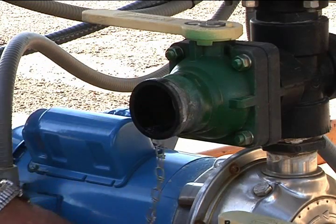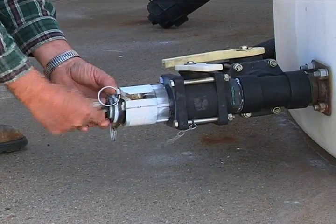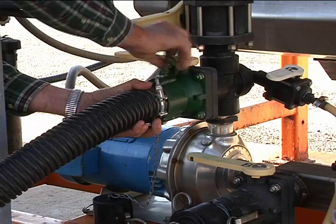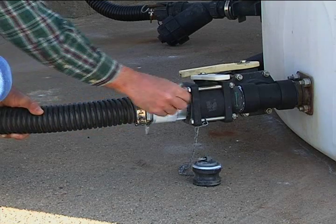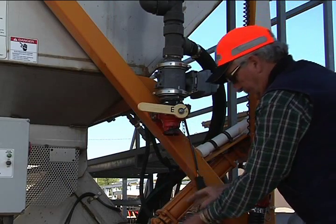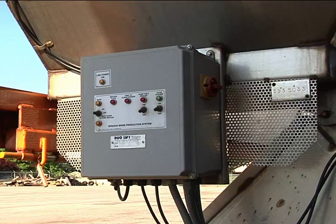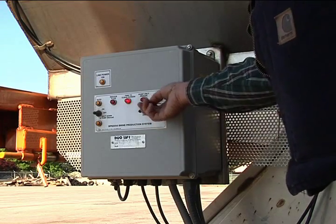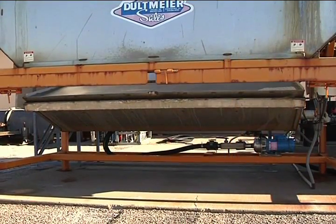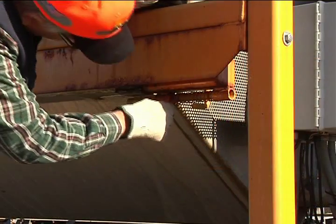The next step is to take off the fitting caps and hook up the hoses to the brine maker. This crew color-coded the outlets and inlets on the hose fittings to make it easier to hook up the hoses to the correct positions. Once all of the hoses are hooked up, turn on the power and close the bottom hopper. Secure the locking pins on the hopper.